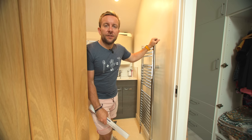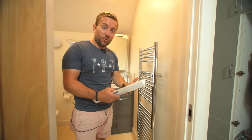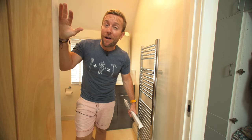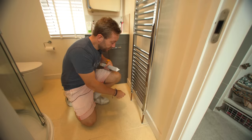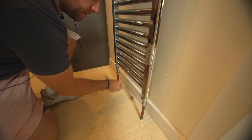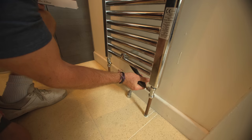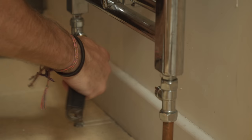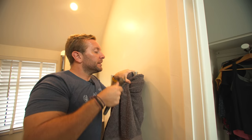So here we are back at my house in my lovely en suite. I've got the perfect thing to show you — exactly how to install one of these and how quick it is to do it. You don't even really need to turn the heating system off. You shouldn't really lose any pressure if you've got a pressurized system, and if it's gravity-fed it will refill itself anyway. First thing you need to do is just isolate the radiator at the valves — turn the radiator off. If the radiator is balanced, try to remember how far you turned this when you closed it, so you can rebalance it again. Then just get yourself a towel in case there is any mungy water.